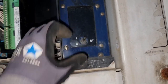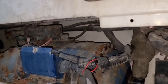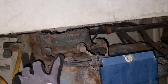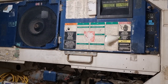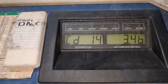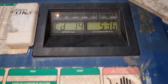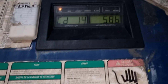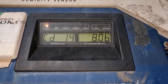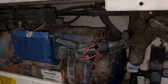And then I need to monitor the discharge pressure from our controller, to see if it will really go high or reach the maximum while it is running, then I need to check again the discharge condition of our refrigeration system. As you can see, the condenser fan motor is now running, and when I check code 14 from our controller, the pressure could not even exceed 11 bar, which is a good sign that there is no problem in our refrigeration cycle, on the refrigerant pressure on the discharge side.